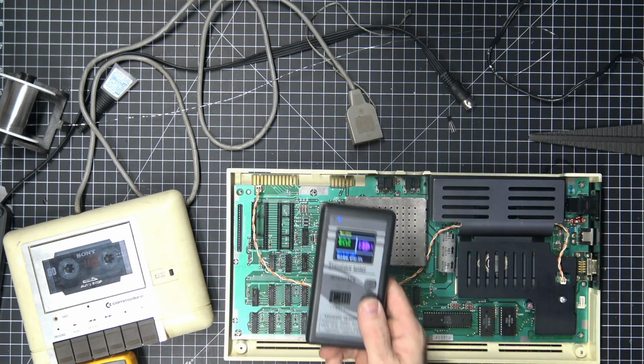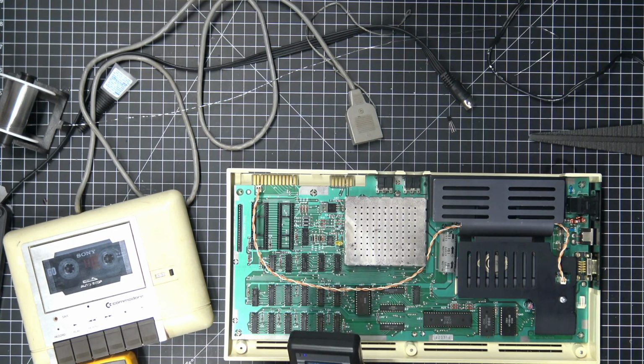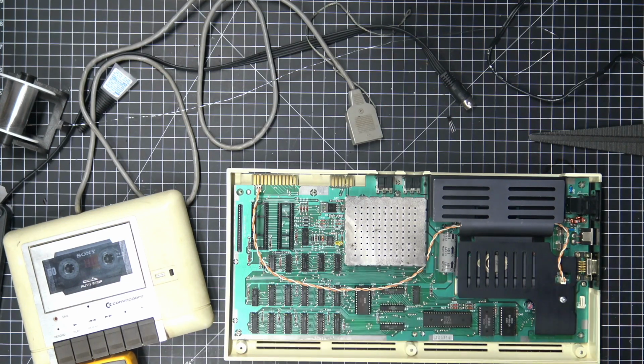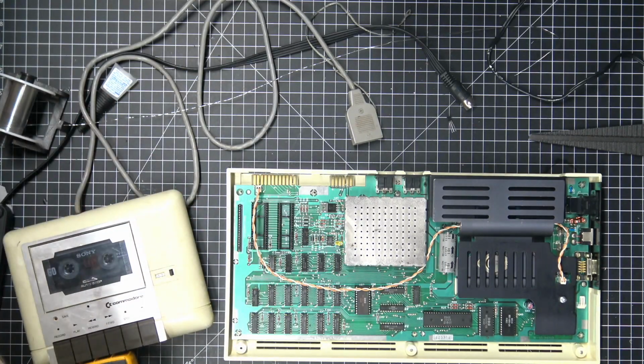Okay, so there's definitely an issue with that. It thinks it's a resistor. Which most clearly is not. Right? Yeah, it's a freaking transistor. It's 1815. Alright. So that's probably the issue. So let's go ahead and replace that one.